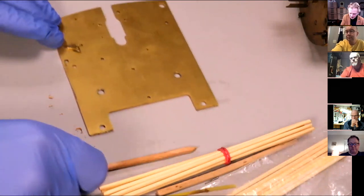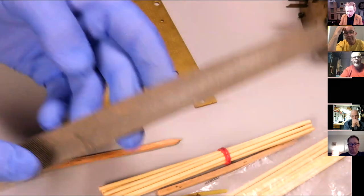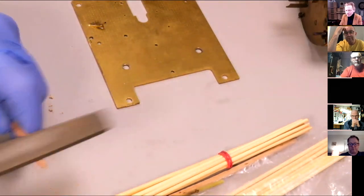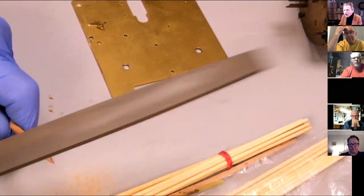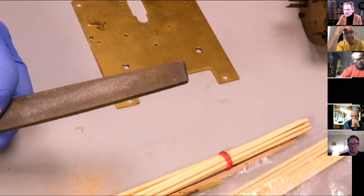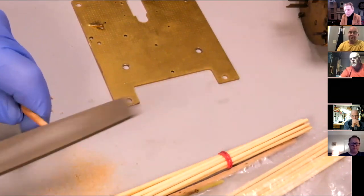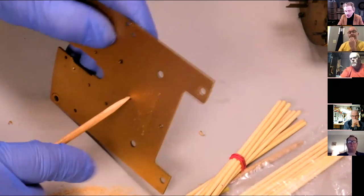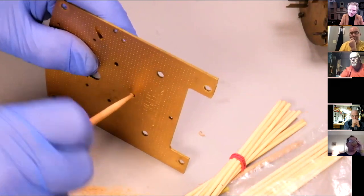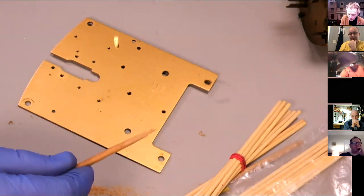And for sharpening the wood, which you can see I've done spectacularly poorly, I actually prefer to use a really coarse new file. I find that much more effective, and it kind of tears up the surface of the wood, which seems to make it nice and grippy. Is that, say, 50? Sorry, I can never see the clock. Yes. Right, okay. So I think a very coarse new file is actually as good as or better than a knife, but there we go. So in the hole, both sides, and you keep sharpening the wood until the wood comes out clean. So whatever book you read, most of them will tell you to do that. And I've got no problem with that, absolutely fine.